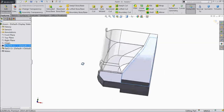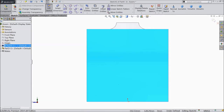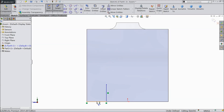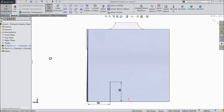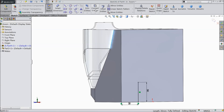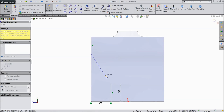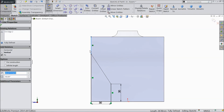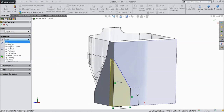Now this fourth part is going to start. Now select back sketch, click normal. Choose line and draw one line up to here, up to here. Choose smart dimension, select 30mm, select 30mm, click OK. Now select this line, then convert entities. Choose line, draw from here to here. Now again draw from this end to this end. Exit this, delete this line. Go to feature and select extruded cut, select through all, click OK.